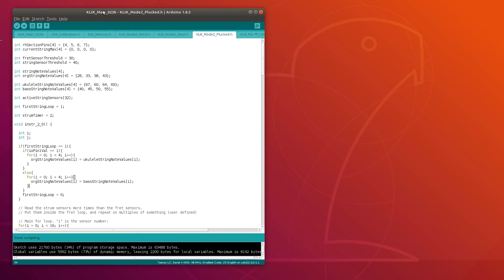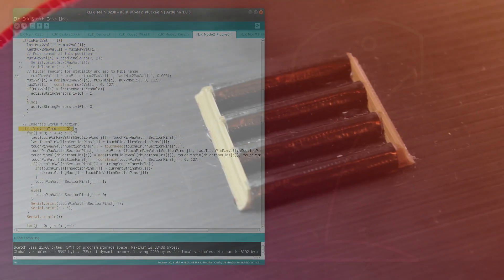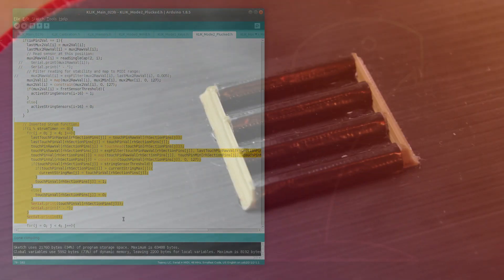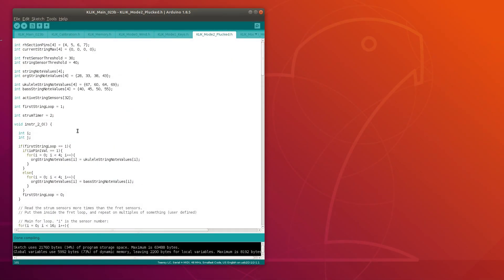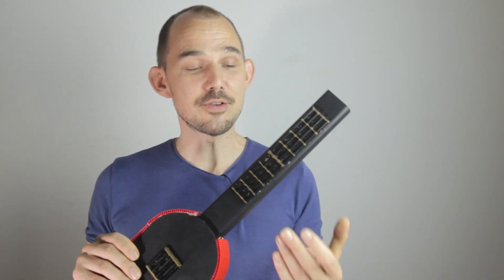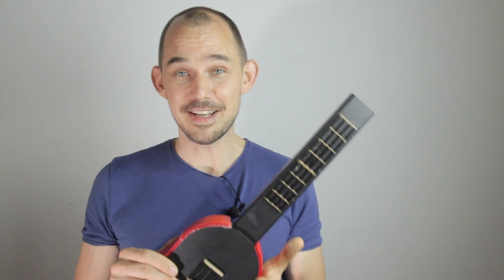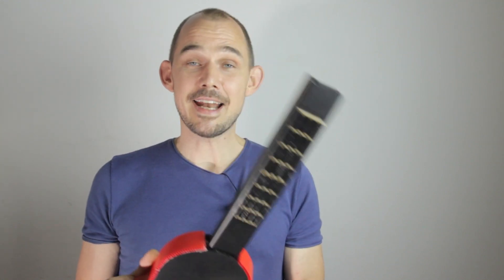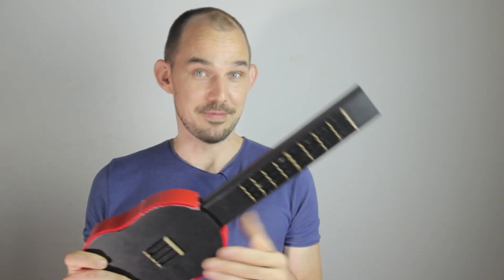The solution was a matter of adjusting the software. Instead of simply reading all of the sensors sequentially, I'm now reading only some of the fret sensors, then the right-hand sensors, then some more frets, and then the right-hand again, and so on. I even introduced a variable in the code which can be adjusted to decide at what relative rate the two groups of sensors should be read. The small delay that this technique introduces on the fret sensors is honestly not noticeable at all — though that might also have something to do with my complete lack of string instrument technique. Whatever the case may be, I now find this instrument to be very playable indeed, except of course for the fact that I don't play it very well.